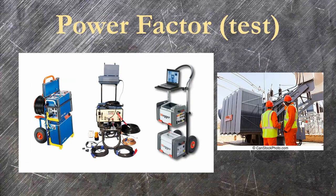The power factor test is performed with miserably heavy and finicky equipment like the Doble M4000. It uses extremely accurate electronics to apply a high AC voltage to something — typically a big power transformer — and measure the phase angle difference between the output voltage and the current. This is a more precise way to determine the quality of insulating media like oil and bushings over regular insulation resistance tests. It takes a hundred times more time and effort, but it does give you a more quality result.